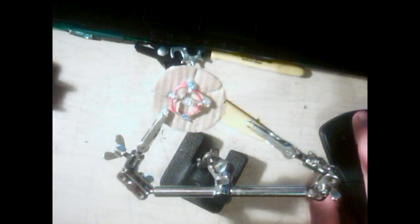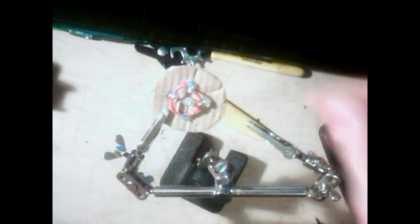So as you can see, I've wired the red wires to the positive LEDs, because you know your standard red is power, black is ground. So we've got the positive LEDs all wired except for that middle one, which I'm going to do very last. That way I can avoid complications and short circuits to that fifth LED here.